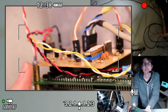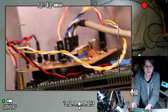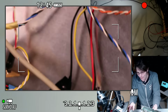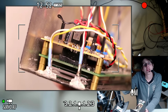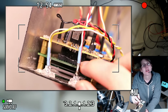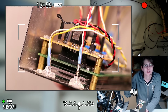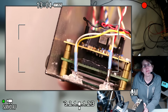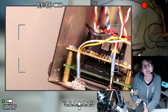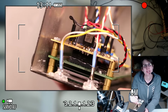And it's a little precarious here. It's actually only bolted down with one screw. I don't know why, or no, I guess it's got 2 screws. Ooh, that's a better view. Okay, so you can see the VFD had this connector here. Oh, that's what was sketchy. I guess it was originally a shrouded pin header designed for a ribbon cable to plug in, but the connector I had was a little bit too big around the edges, so I had to trim off the shroud with cutters. It's a little unseemly, but it'll do.